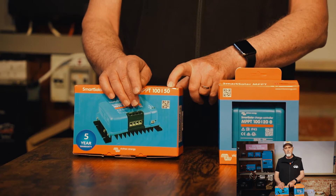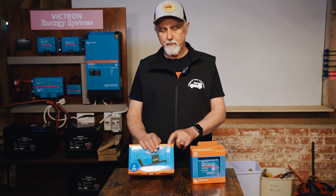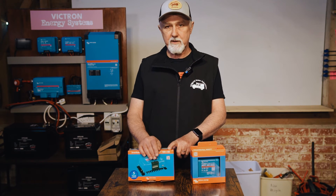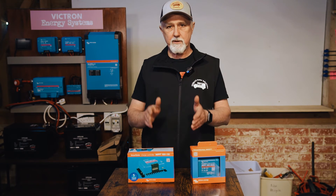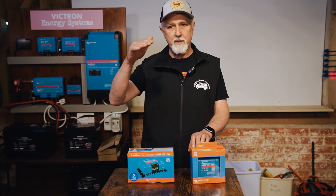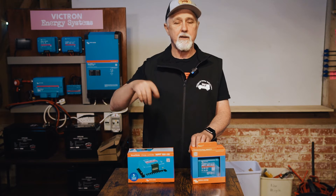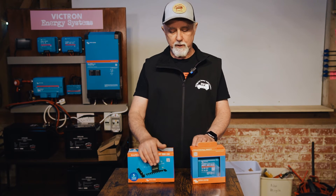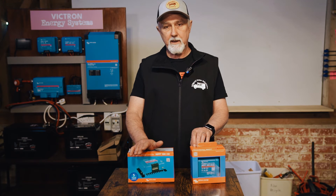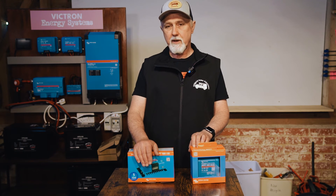The second figure is the output amperage from the controller into the batteries. Our observation has been that when you exceed this, you don't generally fry anything — I've never heard of equipment being damaged this way. What happens instead is the controller simply shuts down, resets to zero, starts back up, the watts and amps climb until it exceeds the limit again, and it resets again, over and over. That said, I wouldn't rule out being the unlucky one who does damage something, so if in doubt, go bigger than you need.